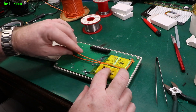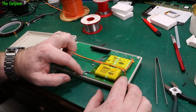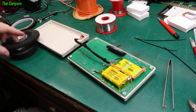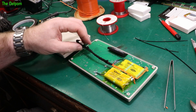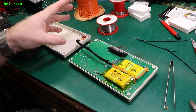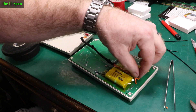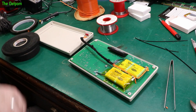I've just got to do some cable management — the ones across here need to be tied up and pinned down. I've been using hot melt glue and it seems to be working alright for holding things down. I'd probably put some cable ties around this to tie those together and then pin those down with glue as well. Besides having this cloth tape here, I wrapped this wire in cloth tape so it can move around a little bit and it actually stops abrasion — if it does move around it gives an extra layer of protection and doesn't scratch the circuit board.